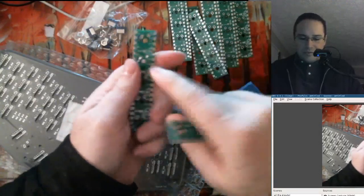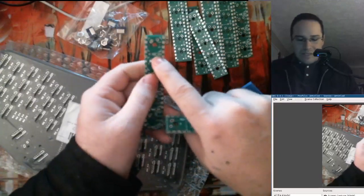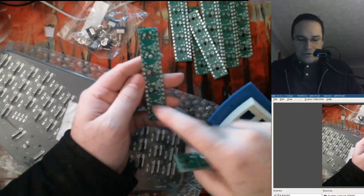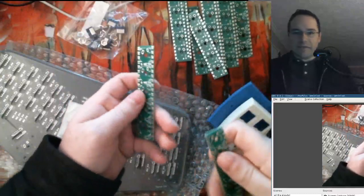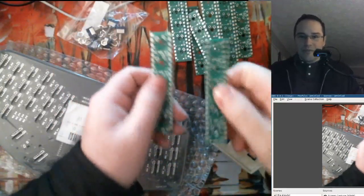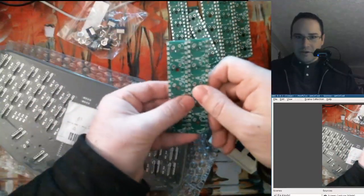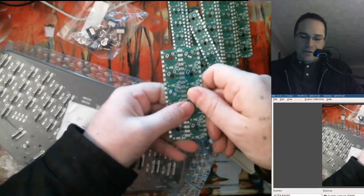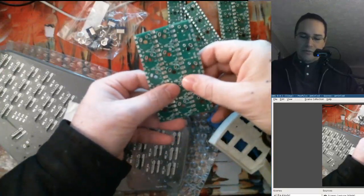And of course, you've got your hole for your diode there. So you're all set. And then this guy sitting over here is your column. And it's the same column all the way down, so you can solder at any point on there. So it's made to eliminate hand wiring difficulties on any of these vertical boards. But it also, by our powers combined, adjusts for quarter U settings. So yes, you can do this, and yes, you can make an ortholinear board out of this.